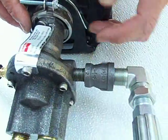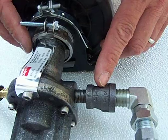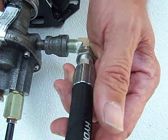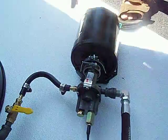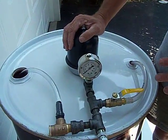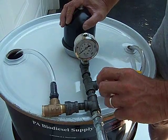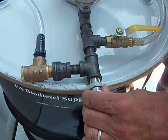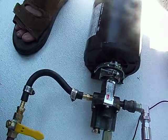The return to the centrifuge is going to be a quarter inch close nipple, to a quarter by 3/8 inch reducer, to a 3/8 inch hydraulic hose fitting, 90 degree — and it takes it right up with my 3/8 inch hydraulic line. I like this way of doing things. A lot of kits just come with a hose barb, but after you use them for a while, if you need to pull your centrifuge off for any reason, you're going to have to slice the hose. Any hose with a hose barb — after a while it stays there. With this setup, you can disconnect the hydraulic hose here or down there, and you can disconnect the pump, so you can always pull the centrifuge and the pump apart.